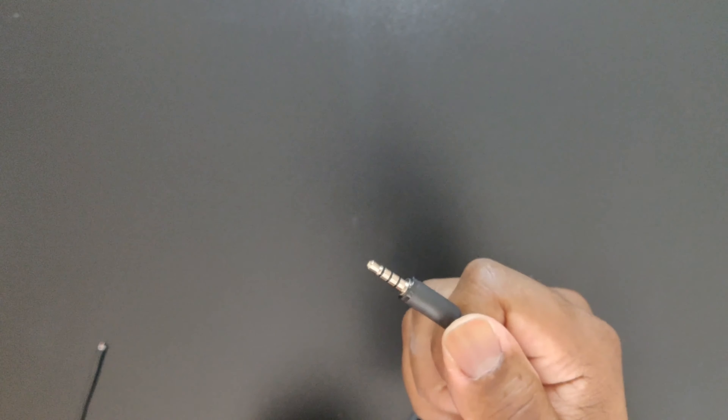Set your razor blade to the side. Go ahead and twist the wires up if you're using the other type of banana plugs. Grab one of the different type of banana plugs. You see how they have the screw on here? This is what makes that different — the wire doesn't go through the hole like the other ones did. These are a little more secure, but if this is what you happen to get, go ahead and line up the red, stick it in the hole. Make sure it's not coming all the way through, because if you have two side by side there's a potential for them to touch.